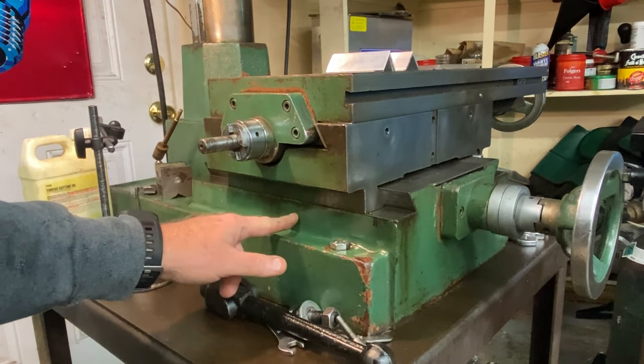All our machining for now is done at least. I've got these counterbored and slotted with the new ones on the ends. I made these brackets up, did a couple of operations on them including squaring up the sides and then cutting this relief in here. That relief goes like this — you can see what I'm talking about regarding having it open down there, because our backing plate's going to go up against that. It really doesn't need anything down in there, and anything stretching across that point was going to interfere with the base anyway. So we just got that out of the way.